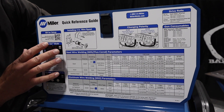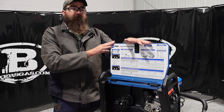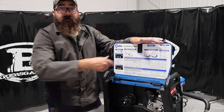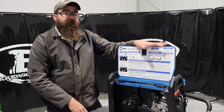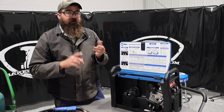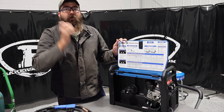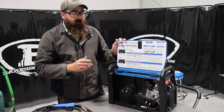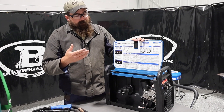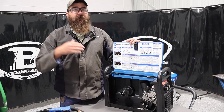In the world of the 142, where does it fit for you? If you're looking at a 142 versus a 211 or a 215, it depends on material thickness and whether you want to run 220 volts. This unit is 110 only. When deciding which welder to choose, look at your power input and material thickness — the 142 is only rated up to 3/16ths. Can you weld heavier? Yes. Is it recommended? No — you won't put enough heat into the material. So keep that in mind when deciding whether to step up to the 211 or 215.